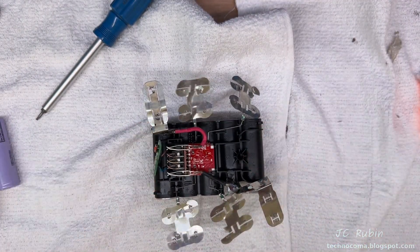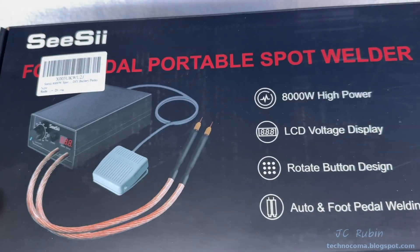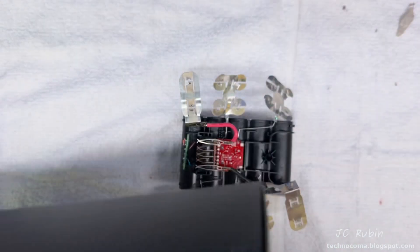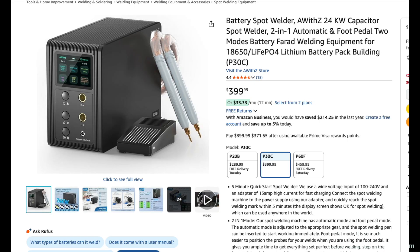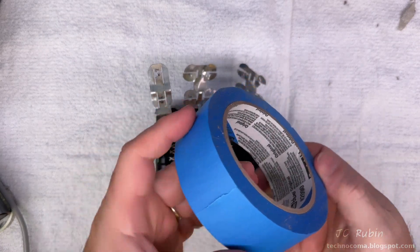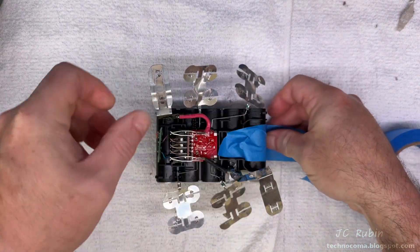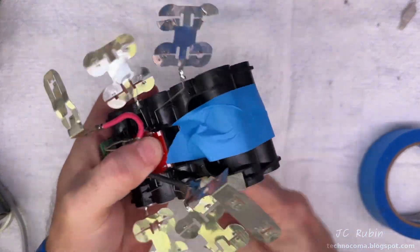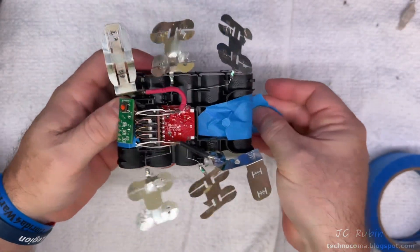This is the welder I use — it's definitely not equipped for half-millimeter thickness, but we're going to try it anyway. I'll post a link below. The one I have tops out at 0.3 mil, so it's not going to cut it. I could spend more and get something that handles 0.5 mil. I'll use masking tape to temporarily secure both sides together and wrap it around to make sure they don't separate. Everything has to line up before you start welding.